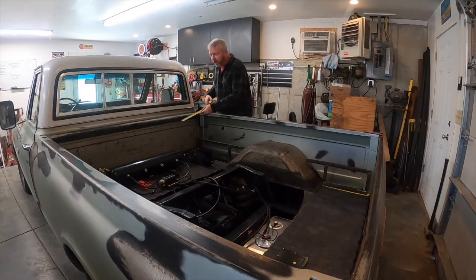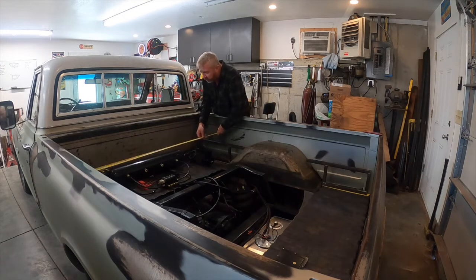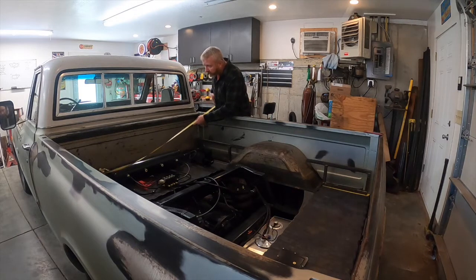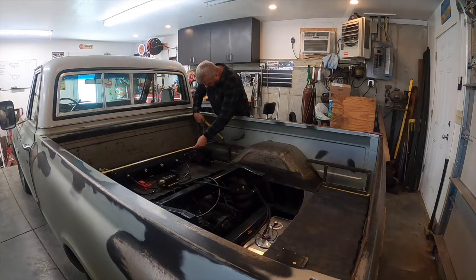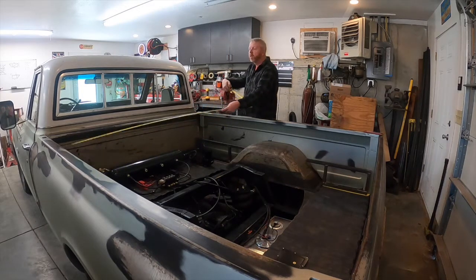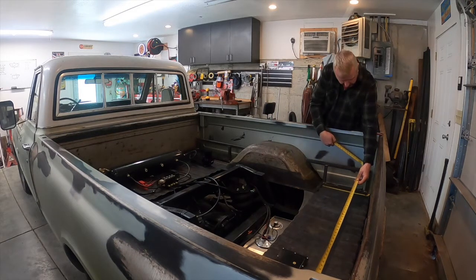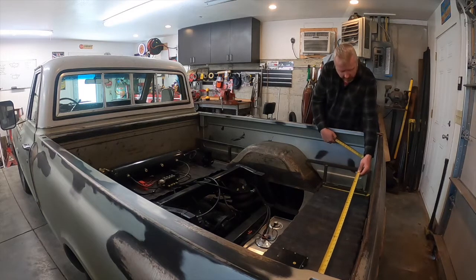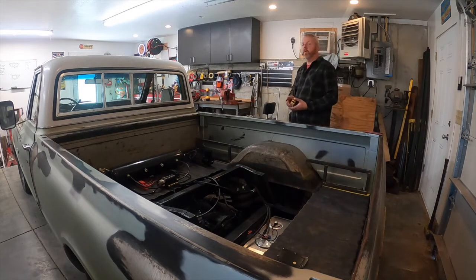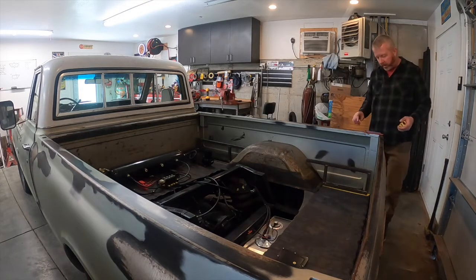I have these brackets set back in here and now I'm measuring the width of my cross braces. This measures about 72 and a quarter, maybe a little more than that. Here I'm just a touch over 72. So I think if I do 71 and a half, that'll give me about a quarter-inch space on either side, and I can just have them all cut to the same.